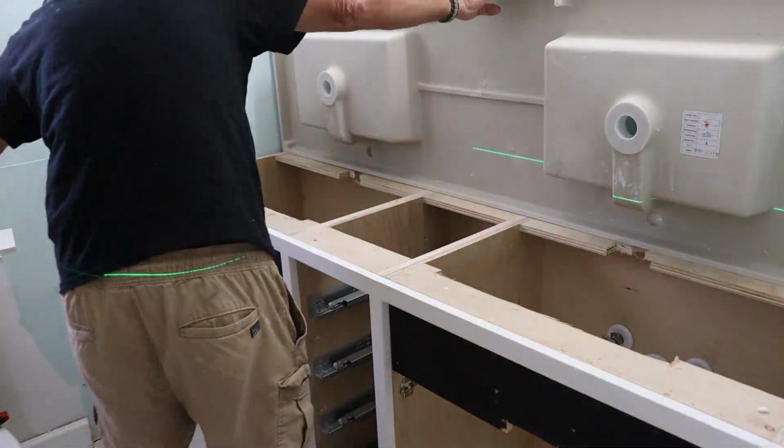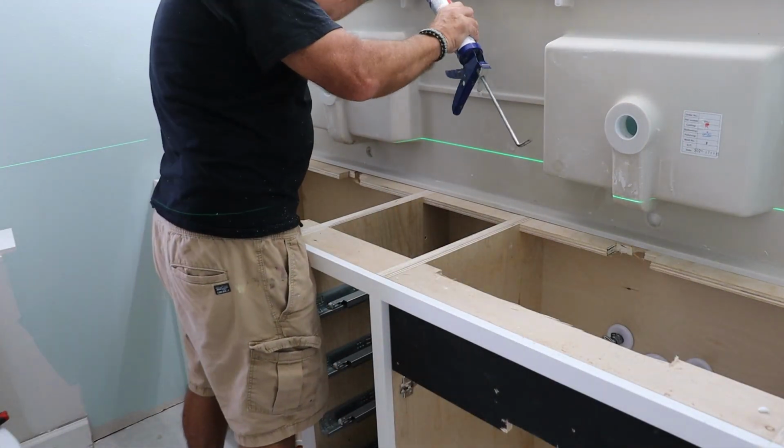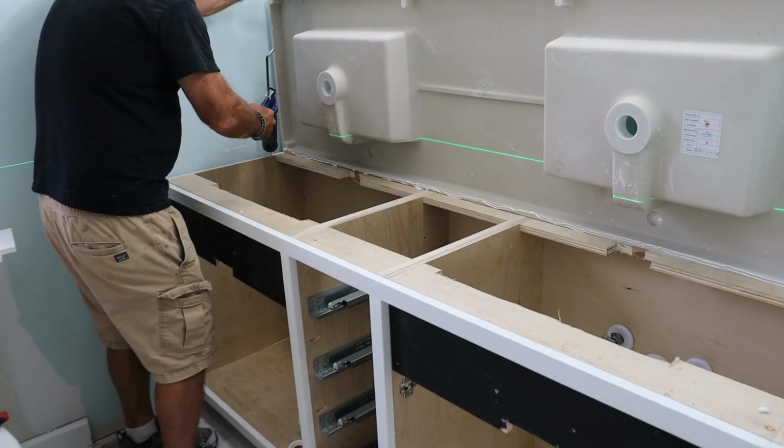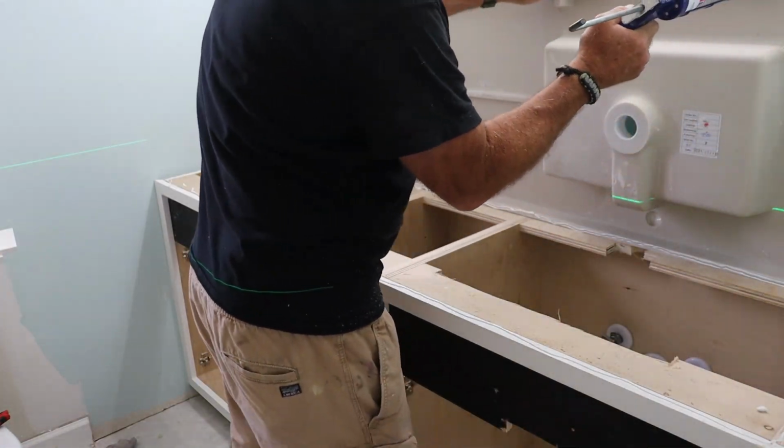With the back piece in, I lifted the countertop and applied more silicone to the base and cabinet, being careful setting it in place, making sure I had about a 1/2 inch clearance on both sides. And yes, that was a little stressful.